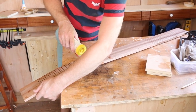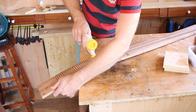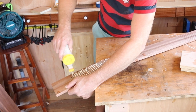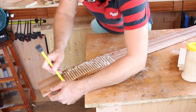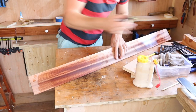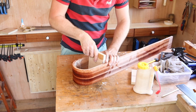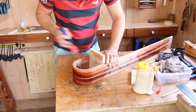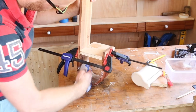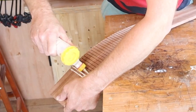I found this really stressful trying not to break the wood. Lots of little cracks, but anyway once I got it to the shape I thought let's pop some glue in every single kerf. I filled up with Titebond 3 and then moved it back into the position I knew it could make it to because we'd just been there before. Then it was just a case of spreading the glue deep as you can into the kerf and then just clamp it. I tried to wipe as much of the glue out as I could at this stage - I didn't want to wipe it out of the kerfs though so I had to be really careful. And then I just did the other end exactly the same way.